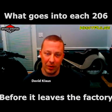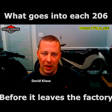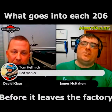Every one of our carburetors, we wet flow at 8 different set points. Every carburetor is within 0.5% off a master carburetor for flow. Otherwise, it's scrapped. And Todd Helmick asks about the red marker.